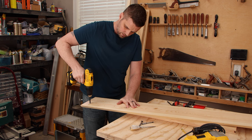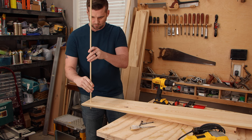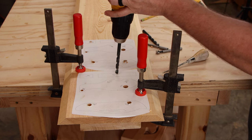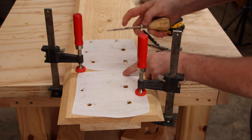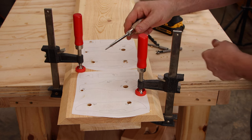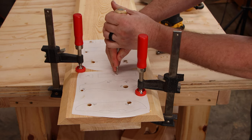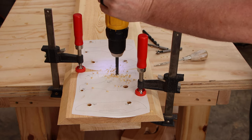When I take this apart I need to flip it over and ream out these four holes for the cars on the other side. If you're using a twist bit that's more flat on the top, a lot of times that can try to skate around a little bit before it bites and drills down, making it inaccurate. So if you want to get it right on that X, use something like a scratch awl, or a nail — anything with a point. Put it right in the middle of that X, push down, and now you've got a place where your drill bit will start.